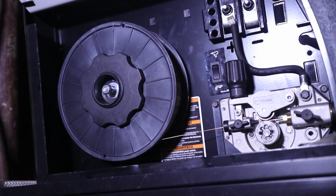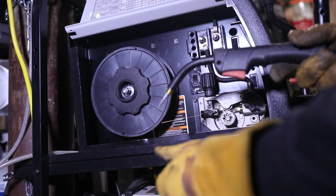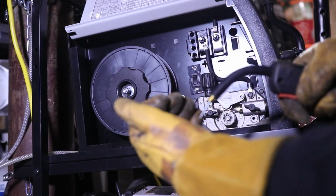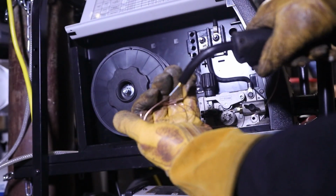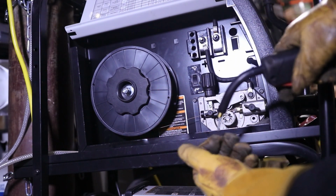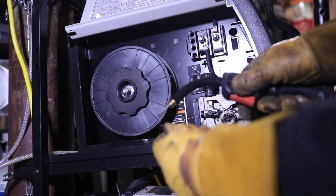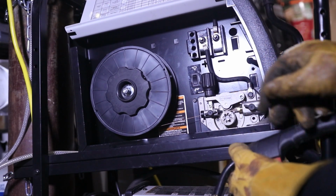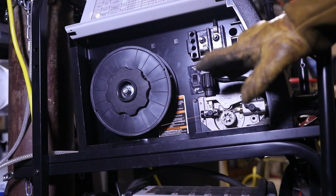Pretty good, okay. So this wire tension here, let's go ahead and make sure that we're set up properly for that. So one of the things I like to do with the roller tensioner here and to test that is just by grabbing this guy, turn it on, and see. And I'm holding on to that with a pretty good amount of pressure, so I'll show you what I'm looking at. There we go. See how it just decides to want to stop? But it still gives you just enough power to be able to push through if there's something at the edge of there without binding up in here. That's what you want to be careful of. It's not going to try to slinky itself into this little liner here, and then you're good to go.